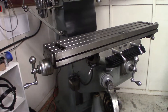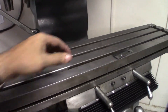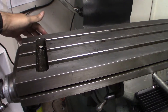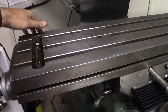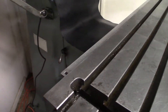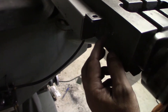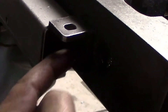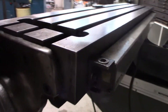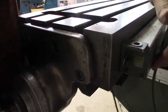I have figured out part of the reason they had the rust - the scales were mounted to the front here. I know they used to run coolant due to the little bit of rust that was on here. The coolant drain holes here pretty much would have lined up exactly with the scales on the back of the Bridgeport. What I did - which will probably throw off a lot of OCD people - is I just moved all the scales down about an inch or so, so instead of the screw going right into the drain hole, this one at least leaves this drain hole open.